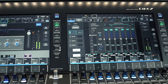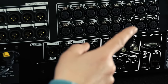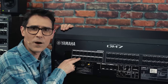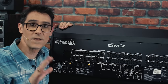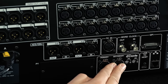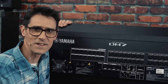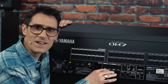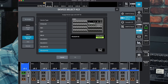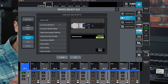Not that things weren't already pretty good. Let's take a brief look at the rear. We can see 32 recallable mic preamps and 16 analog outputs — enough for a small live event. Though if you really want to make use of the 120 input channels, take note of the built-in Dante module. This provides 144 channels in and out at 96kHz, so you can also cater for additional inserts, direct outs and recording feeds. Up to 24 Dante devices can be mounted for patching, while the usual range of Yamaha and third-party supported devices can be controlled, including IO racks.